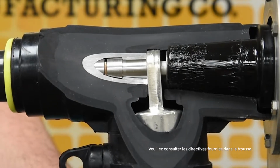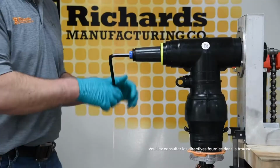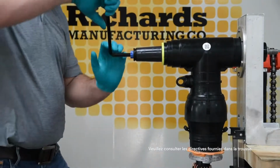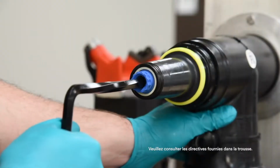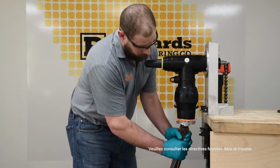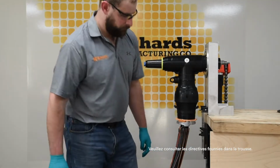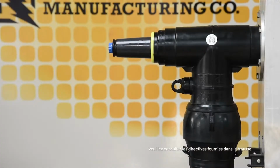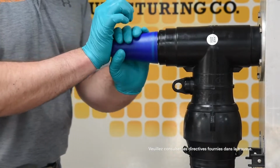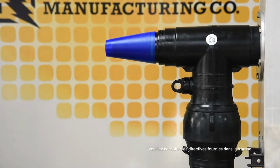Drive the assembly to the full required torque of 50 to 60 foot-pounds. The supplied hex tool will yield once that torque has been achieved. A final tug on the power cable should result in no movement at all, as the assembly is now completely torqued. The provided shipping cap may be reinstalled on the load break interface to keep the interface clean until a mating component is installed at a later step.